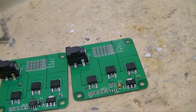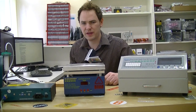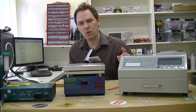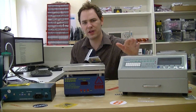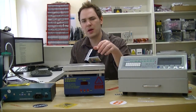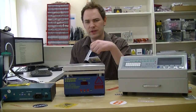At $50, it's way cheaper than the $220–$250 reflow oven, and it takes up a lot less room in your workspace. It's not as automated, but you can see the parts and adjust them. Personally, for one-offs, I'm going to stick with the reflow oven — it's set-it-and-forget-it, you put the boards in, start the profile, it goes, it works, no worrying about it, no exposed heat. But for small labs, I could definitely see the value of the hot plate, and I know a lot of people prefer it over the reflow oven.